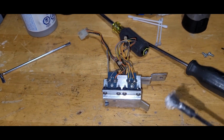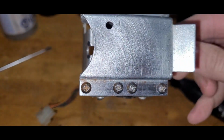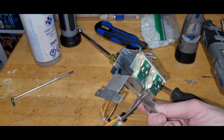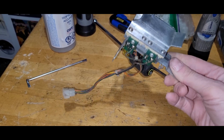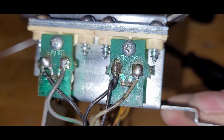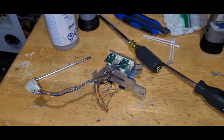This is the wire brush adapter for the screws. Could probably hit that last one up a little bit better now that all the screws are in. But yeah, so clean the optos with rubbing alcohol and Q-tips. What I'll do is probably plug this guy in and test it, just make sure those optos are good. The solder is good, so I didn't feel the need to reflow them. Yeah, okay, well, we'll move on to the next thing.